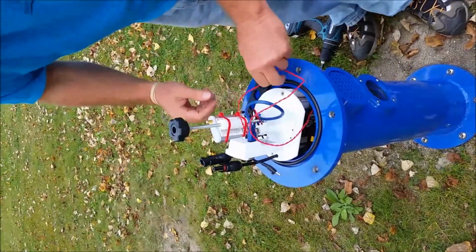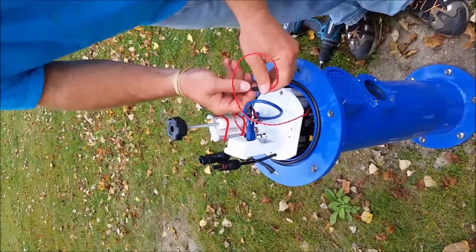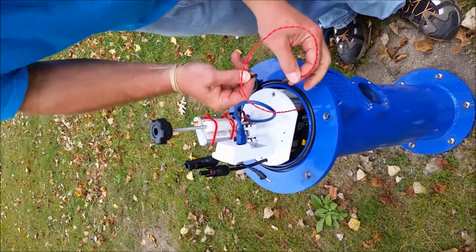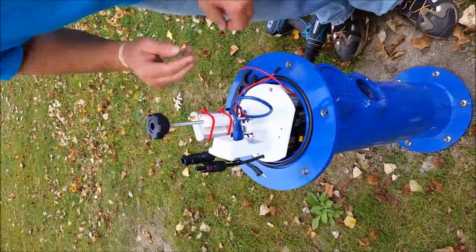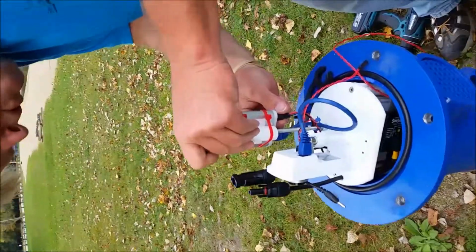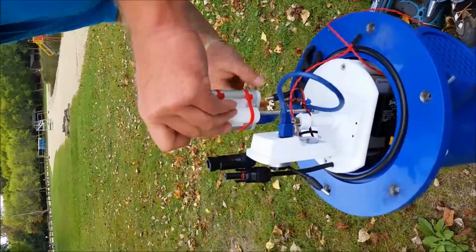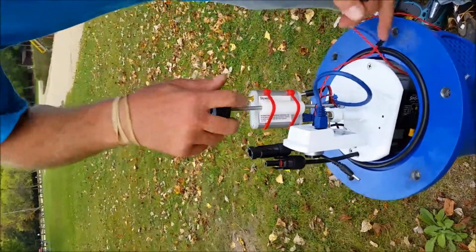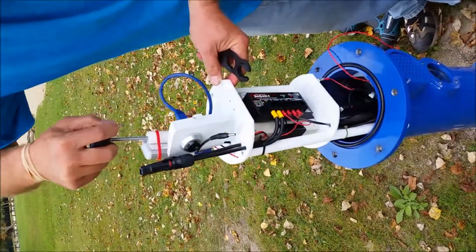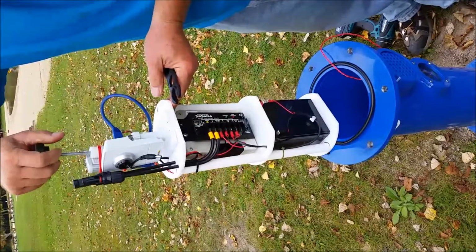For the rest of the disconnect procedure, you have a small micro connector here that's for the speaker. Just push your thumb down on one end and pull the larger end away. And the power connector for the modem, you unplug that. Now you're ready to pull it out, making sure to orient the discs so that they slide out easily.